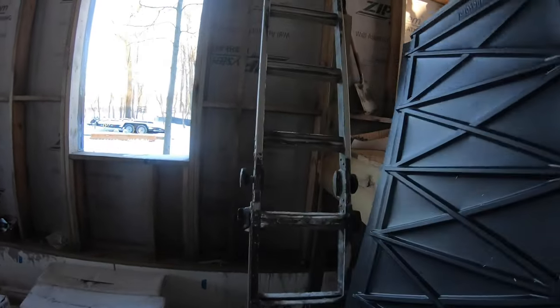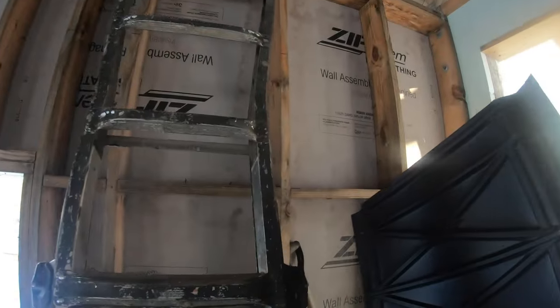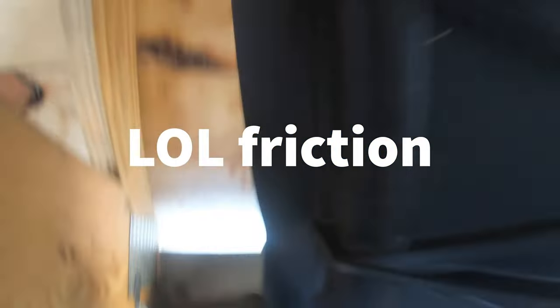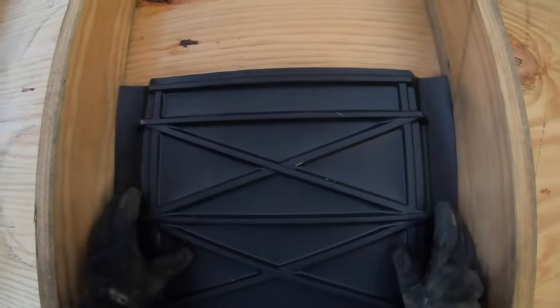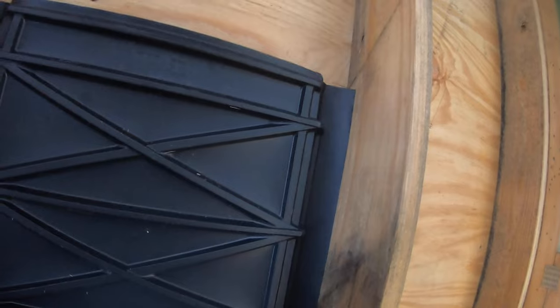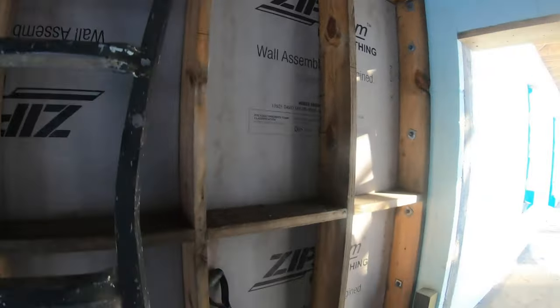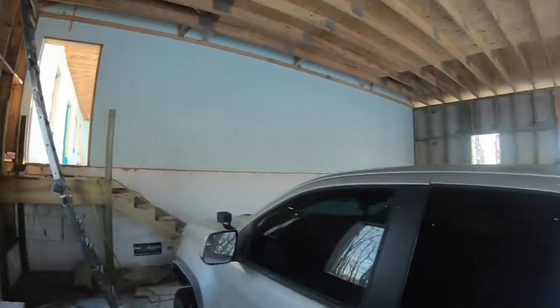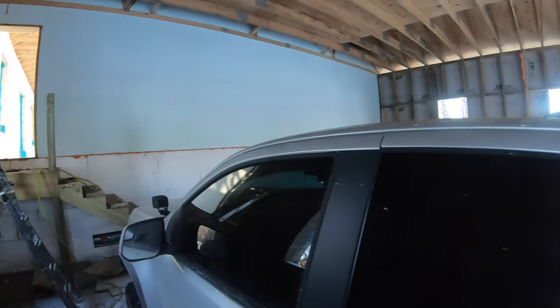All right, you guys are coming with me. Let's see how easy one of these are to install. Like I said, I don't know if these outside winglets are gonna just stick in by gravity or if we need to put something up in here. So no, it would probably fit. I don't know how wide we are right here, but it looks like we're gonna have to put a little staple in. And like I said, we're really gonna have to turn down the power because it looks like we're gonna have to nail straight up into the roof sheathing. And we definitely don't want a staple going up through the roof sheathing and going all the way through. So we'll turn the power way down, angle the staple so that way we don't have any problems.